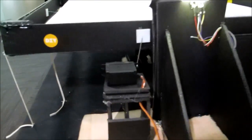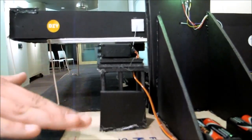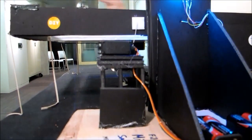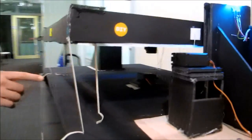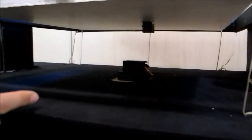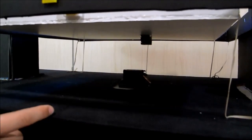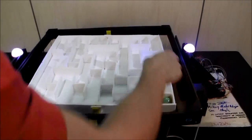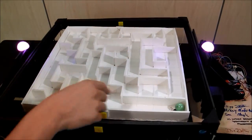The entire system works off two servos. This is the first servo and it tilts the system up and down along the Y-axis by moving this entire frame on the outside. If you look over here, there's a second servo and that tilts it along the X-axis. It's mounted on the underside so that it's still on the axis of rotation but still has enough mechanical advantage to move the entire system. The first servo tilts the outside frame and the second servo tilts the inside frame.